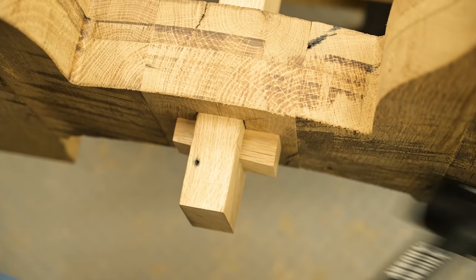These are going to set across the top and get dovetailed in. They'll provide some support for the weight in the top, especially in the middle, but really the top's so thick it doesn't need any help. What this mostly is going to do is, since we only have one stretcher in the middle of this base, even though it's wedged, the base might kind of want to move this way or have some racking. Dovetailing these into the top is going to make sure that we have a solid shape.